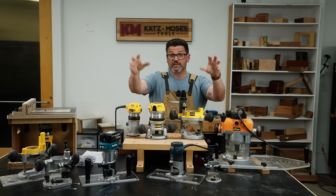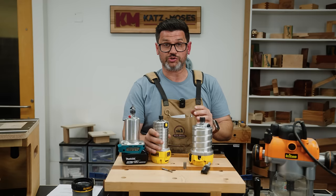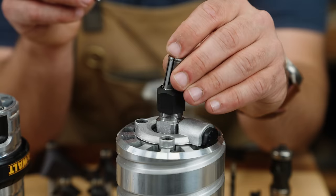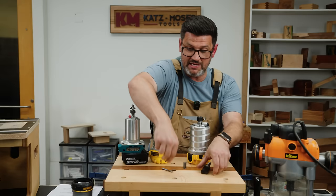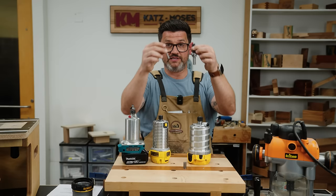Now let's come to the bench. I'm going to show you the anatomy of each type of router and give you some vocabulary. These are the motors of the small guys — they come in battery or corded. I prefer battery. The difference is they only come in a quarter-inch collet, whereas when you move up to a mid-size or full-size router, they will have both quarter-inch and half-inch collets. The shank is the area below the cutting area. This router will accept both; these smaller routers will only accept a quarter-inch.